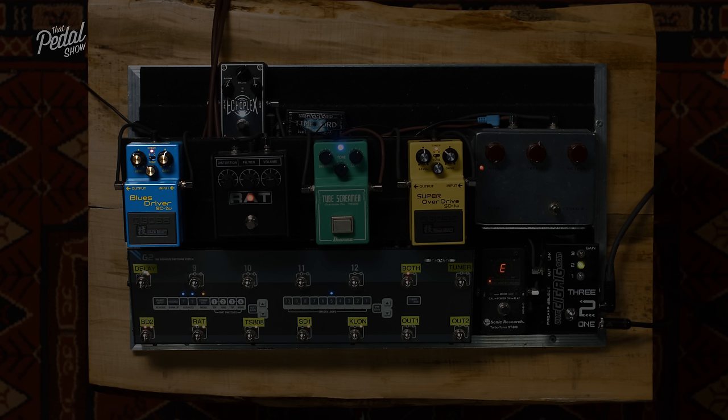So when we talk about headroom, we're talking about dynamic range, but also the added thing of changing the slew rate in that particular op amp. I think the more common understanding of headroom is as it relates to voltage, in terms of how much gain you can get before compression. But actually, all of these things we're talking about today have a tonal relevance. EQ can be heard, but it can also be felt.